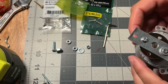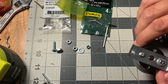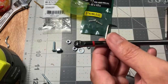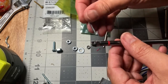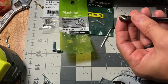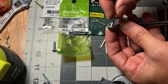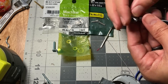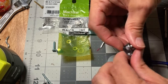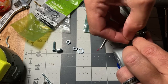That's how you build the mechanism, and now we're going to put on this bar linkage thing — like from RC cars, I don't know what they're called. You use a number four screw for that because it will fit right through it. Then you want to put on some washers, and I even put some nuts on it, because you want a little distance — you want it a bit higher than the rest of the screws on top of the attachment so when it rotates it won't catch.